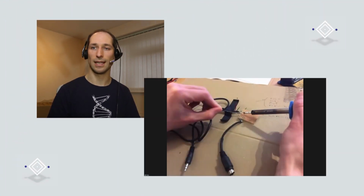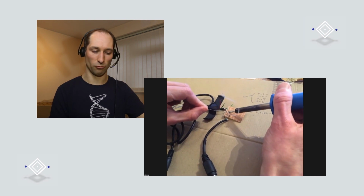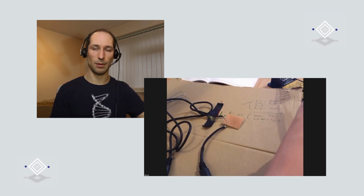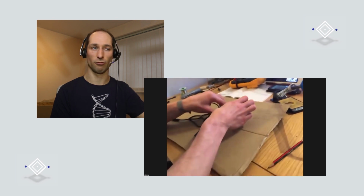That's great. So you've now got all of the ground signals connected together. You now want to pick one of your mini jack cables. That's going to be the audio out of the computer into the radio. And you're going to connect the tip of that one onto the data in pin, which I think was red on your cable. So you're going to connect the wire that was the tip on one of your mini jacks up to the red one going into the radio connector.